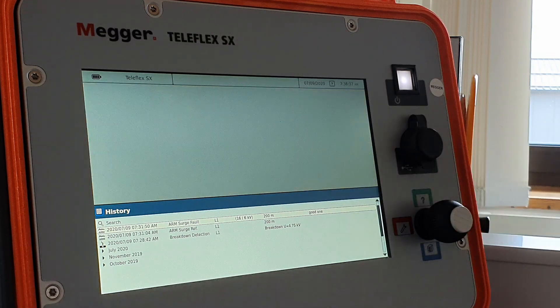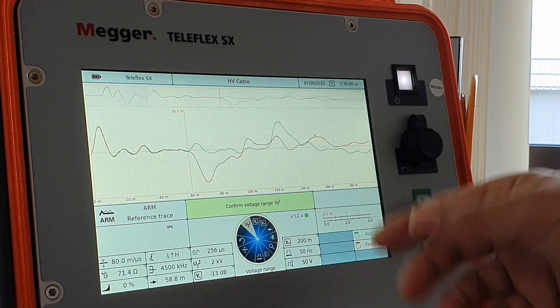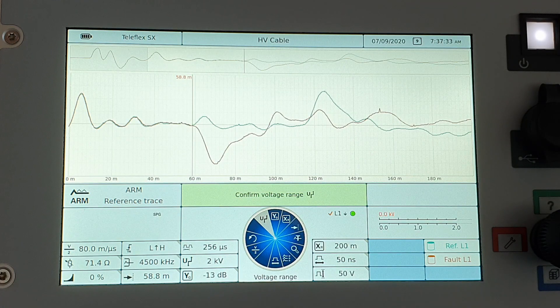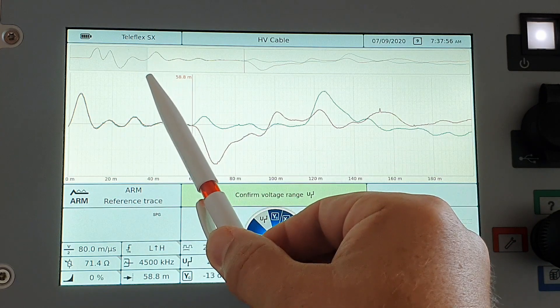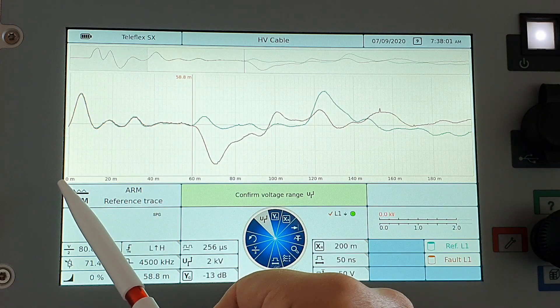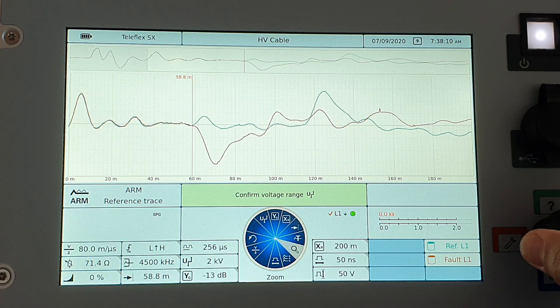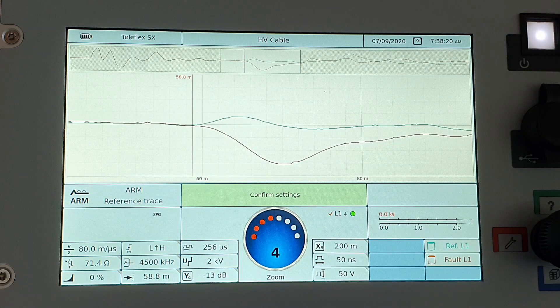Here is my measurement from a moment ago. I can see from the barrel symbol that it comes out of memory. I could superimpose a new measurement for comparison. On the screen I see the most important data from the measurement out of history: it was taken with a 50-volt pulse of the TDR at 50 nanoseconds — a narrow pulse gives you more detail. I was in the 200-meter range. In the top window I see my zero start point; the rest is inside the van so it's outside the image. In the zoomed view, clicking into zoom automatically zooms around my end cursor, and the top window always shows where I am on the whole cable length so I don't get lost.